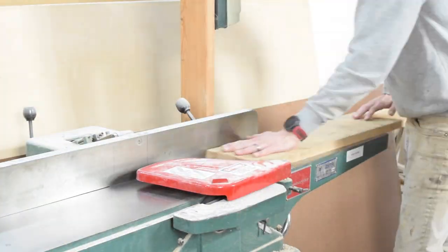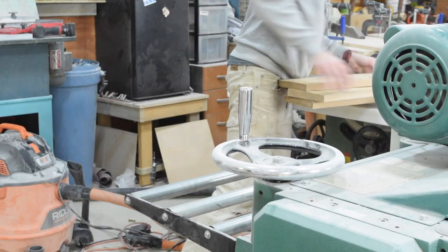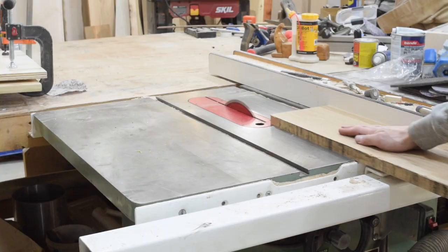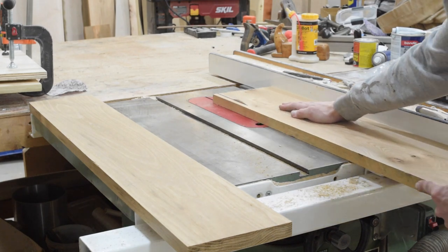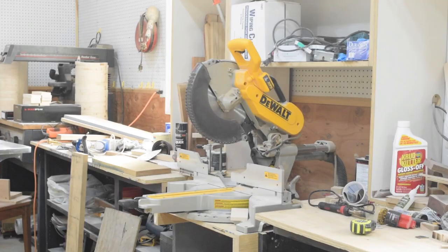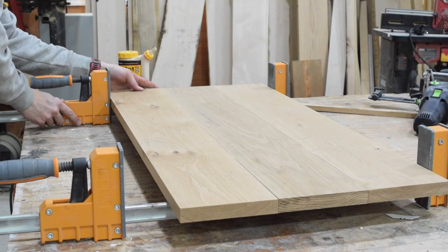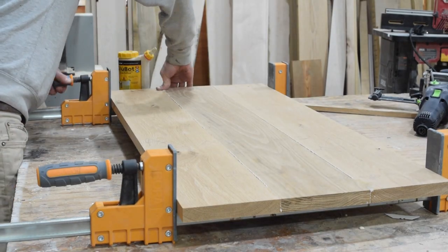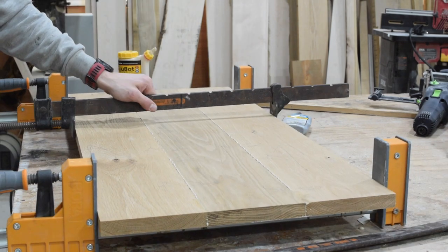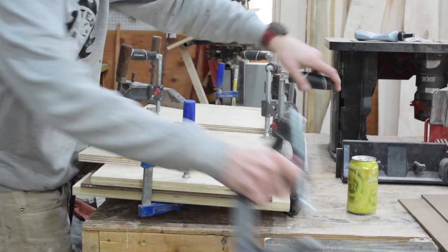With this build, not only are there going to be cabinets — this is a locker room, mudroom, hall tree style build with a shoe bench and an upright cabinet — there is a bench top, and we'll be going with white oak for that. I'm a big fan of white oak. I love the smell, look, and feel of it. I love how it looks with an oil finish with that golden color. White oak, in my opinion, is the best wood to work with. It's pricey, super durable, super hard, and definitely worth the extra money. It's a super simple glue-up — joint the board, plane the board, rip them to width, glue them up, run through the drum sander to get rid of those glue lines, square it up, and that's it.